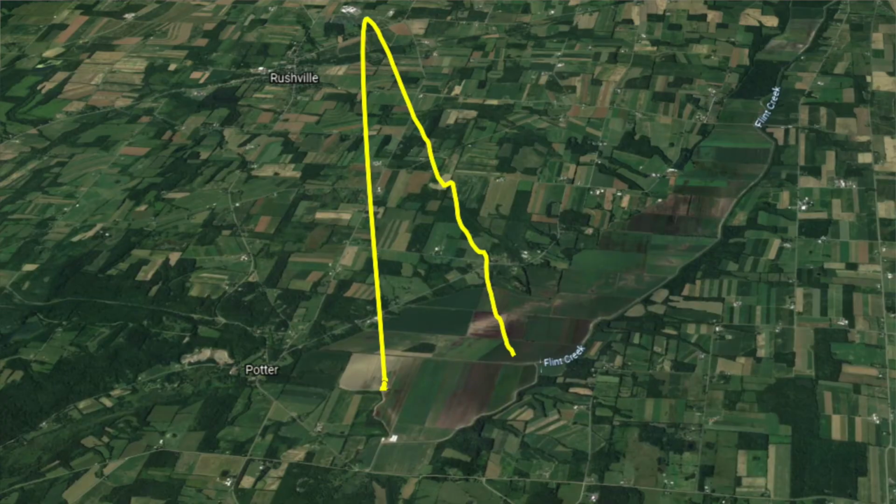This allows us to obtain and view live flight data like altitude, temperature, pressure, and acceleration. For tracking purposes, a GPS module with an additional active antenna is used along with a backup tracking device, the Beeline GPS. Since the airframe is made of carbon fiber, which is an RF blocking material, external antennas are mounted to the outside of the rocket for the 900 MHz receiver and the GPS.